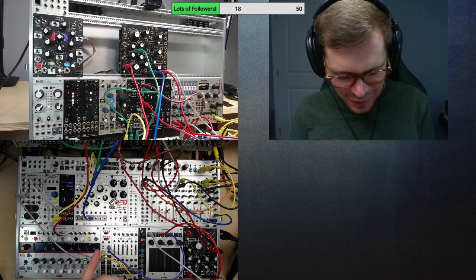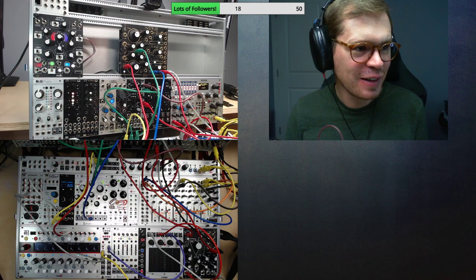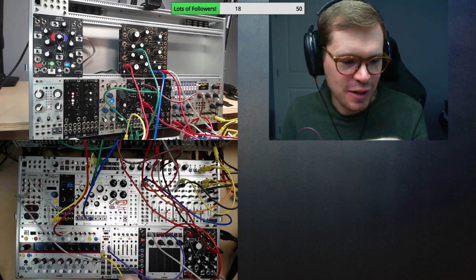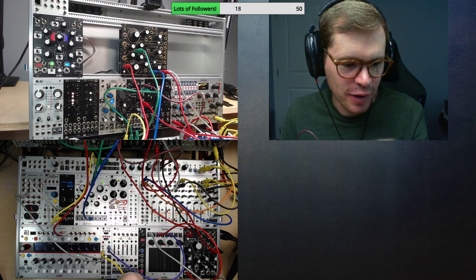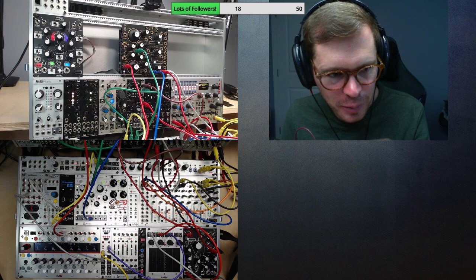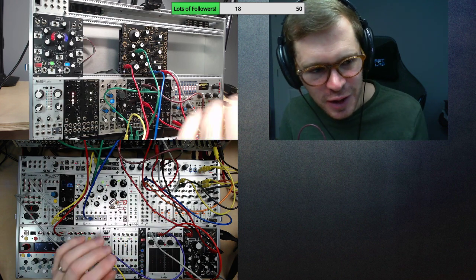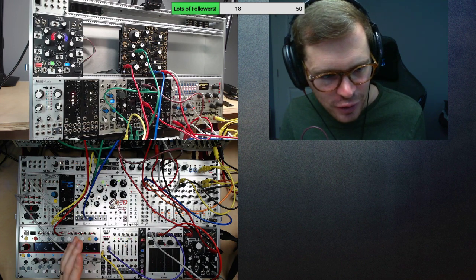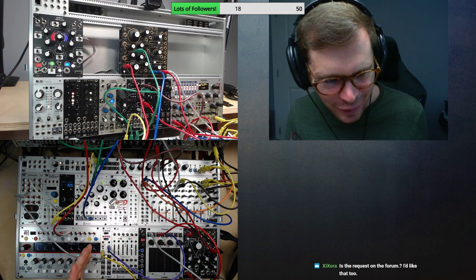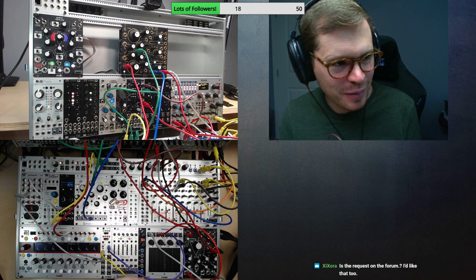Oh yeah, look at that. You can trigger it by hitting the cable yourself. Measure resistance over the pot to see if it works. I guess that's essentially the point of it, right? I'm gonna have to take a look at the back of the board. I don't know how easy it'll be to get to that, but when these modules have PCB boards that are just stacked on top of each other, there's usually screws, right? And you can just unstack them. There's no soldering between the boards. There must be a ribbon or something like that.